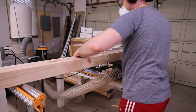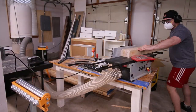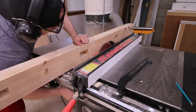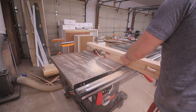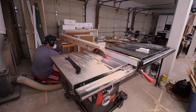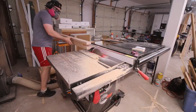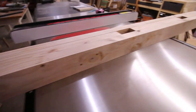I'm running the glued-up posts through the jointer, just so they're silky smooth and square. If you don't have a jointer, that sucks. Now that one side is square, I'm going to run this through the table saw to square up the other side. I also have to build an extension table — this is getting ridiculous. I'm running the final two posts through the table saw to square up their sides so they match the first one, and they can all look visually appealing since they have to be on the wall for the next 20 years.